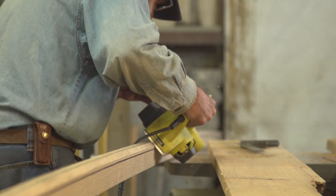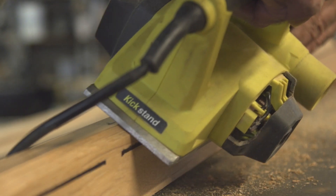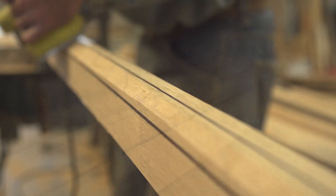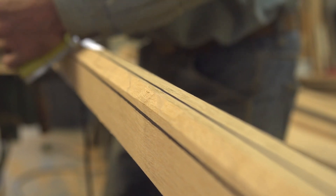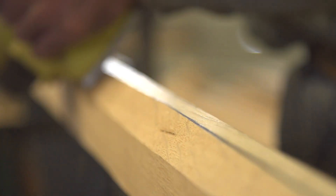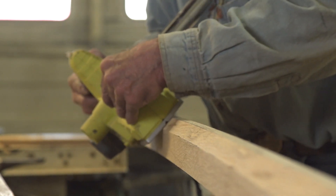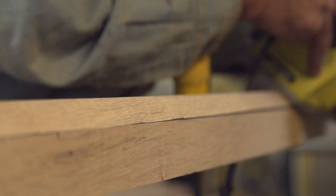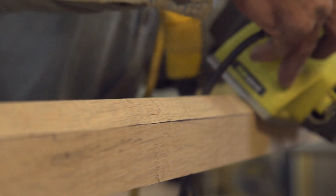The first pass is done by putting that groove on the forward table right on the corner so it doesn't slide around all over the place, and you can just make one cut one end to the other — you get it about half done right there. I really use the electric plane an awful lot like people use a hand plane; it's not set very deep. I have to make many little swishes to get down to the line. The idea is not to plane up to the black line — it's to plane the black line off on both edges without going very far past it. You'll see the slight little remnants of the black line in some of the shots; that's how accurate you can get with a plane like this.